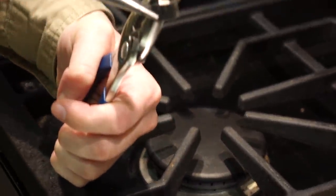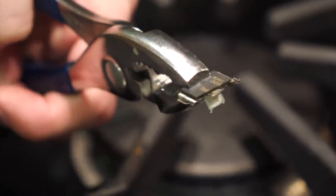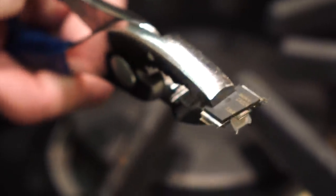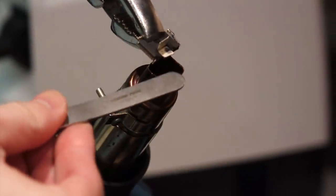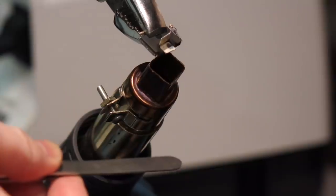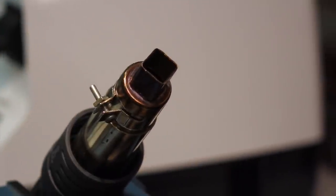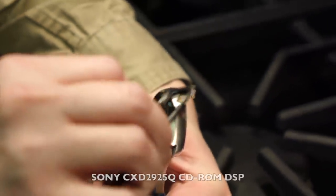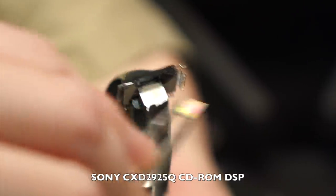There we go. So I'm pulling the lead frame off. I missed that. And now what I can do is push the die from the top while heating it up, and it will just pull off from the package. You just tap it off? So I will just push it. Oh, okay, I can see it from here. Off. Nope, got it.